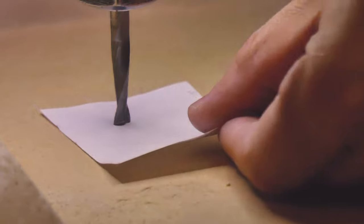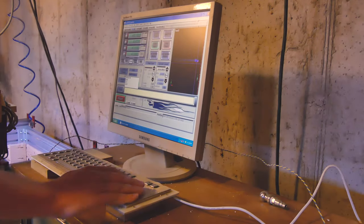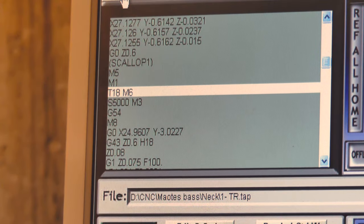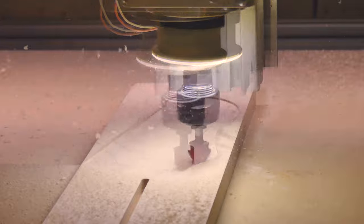This one gets me all the time. After you do a tool change, verify that you have put in and zeroed the correct bit. I got this one all set up, but I noticed that it was a scallop toolpath and not the boring operation that I was anticipating. So let's try that again, this time with the right tool, the 3/4-inch ball nose tool, like the code called for.